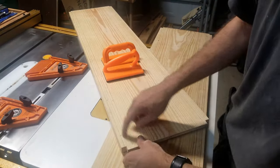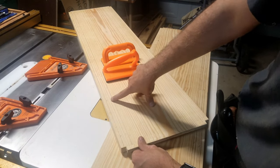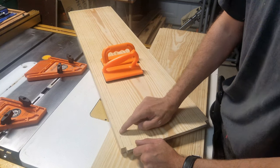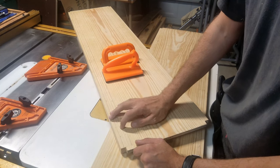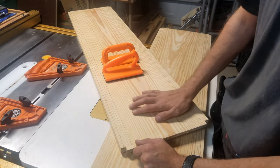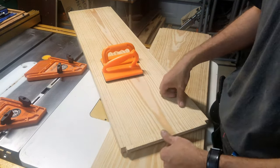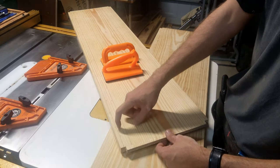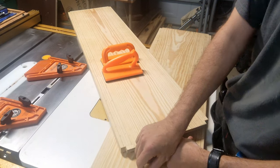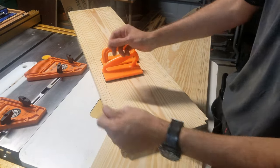So I made lines where I'm going to cut grooves for the sliding doors. I'm going to do about 5/16 for the grooves, and then a 1/4 inch in between them, and then another 5/16 groove so the doors can overlap. I'm going to do 3/8 deep on the top, and then only 1/8 inch deep on the bottom. That way you can slide the doors in.